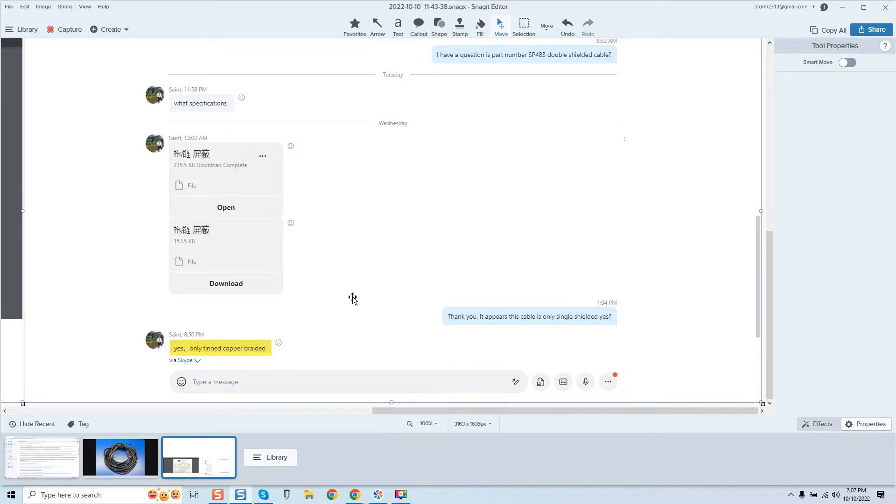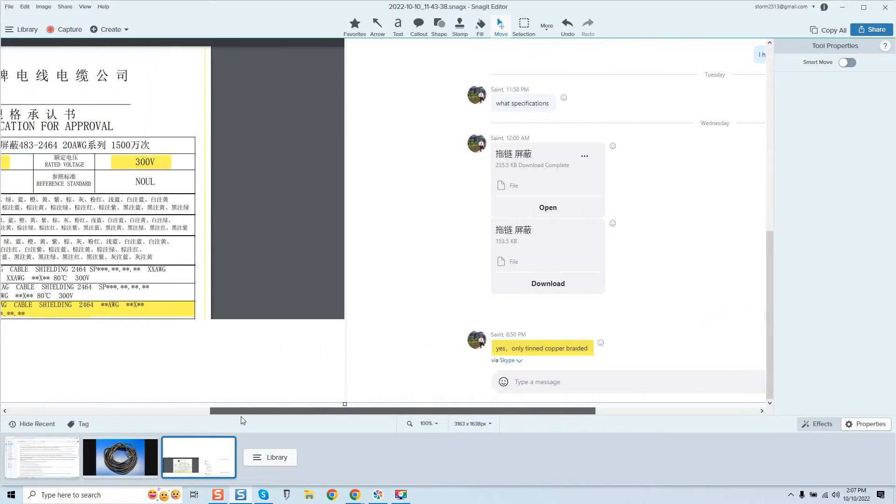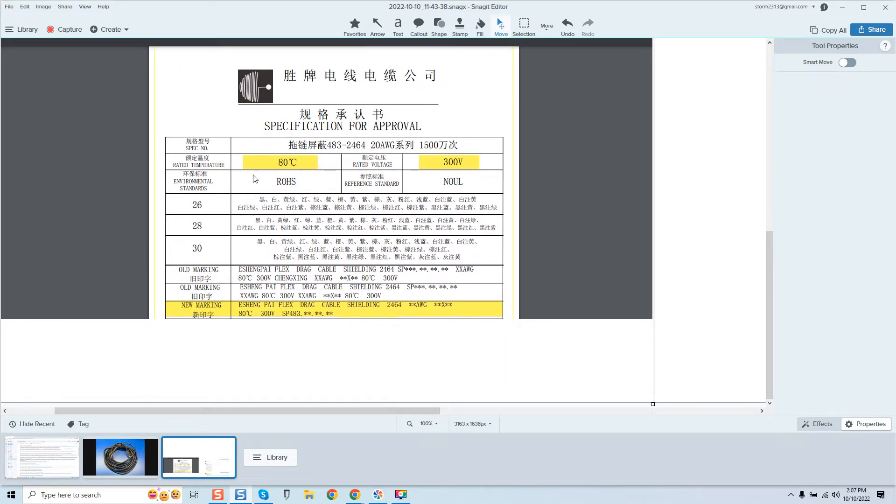If any of you have watched my channel, you understand that two levels of shielding is optimal and mandatory for VFD cables. The reason is that we have two differentiating frequencies of EMI — high and low frequency. VFDs are most susceptible to producing large amounts of EMI, and we want to make sure it doesn't escape. When we use two forms of actual shielding, we're trying to ensure it's condensed and minimal. You're never going to totally eliminate it, but you must mitigate it as much as possible. This is best practice.